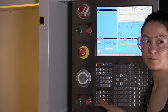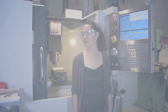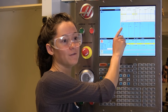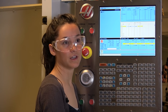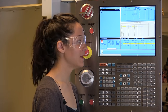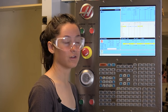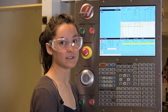I'm going to stop the spindle with this stop button, right next to the clockwise button that started it up. Now that you've found the edge of that part, you're going to want to tell the machine where that zero is. To do that, we're going to switch into this work zero offset menu and work in the G54 line here. To switch to that menu, you're going to press this offset button, and that will highlight the menu we're working in. We just zeroed it in the Y direction, so I'm going to use the cursor arrows to make sure that yellow box is in the Y axis and in the G54 line. Then I'm going to use this part zero set button, and that will zero it out where that tool currently is. You can double check in work G54 and Y — it's all zeros now because we just zeroed it there.